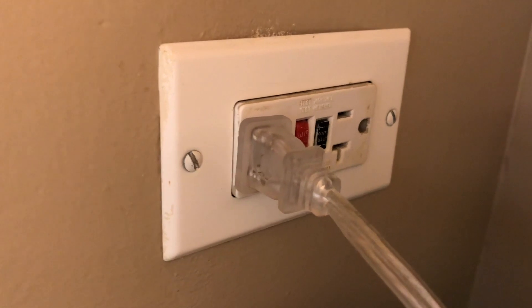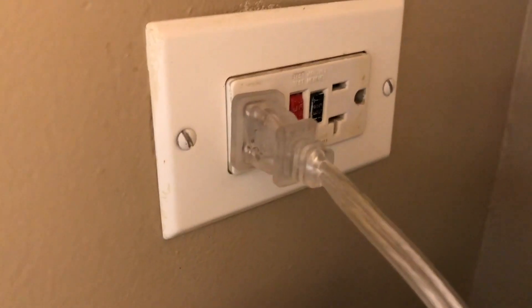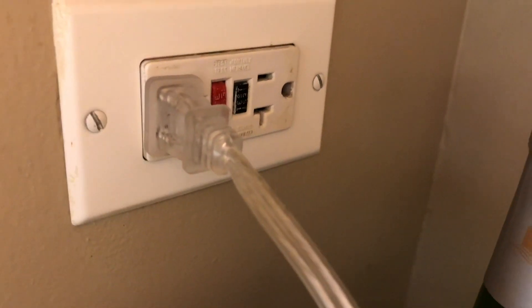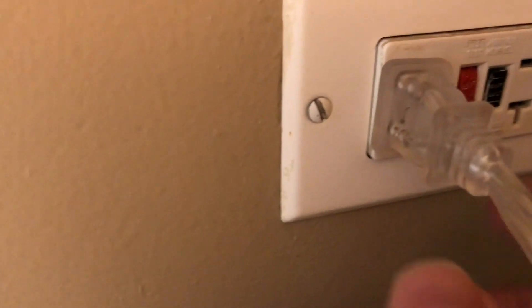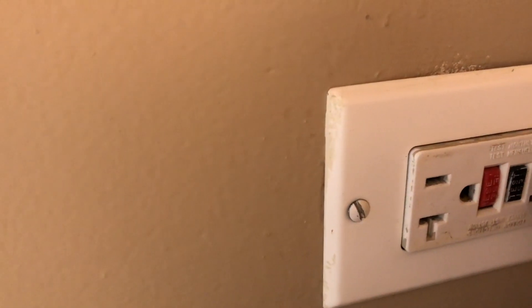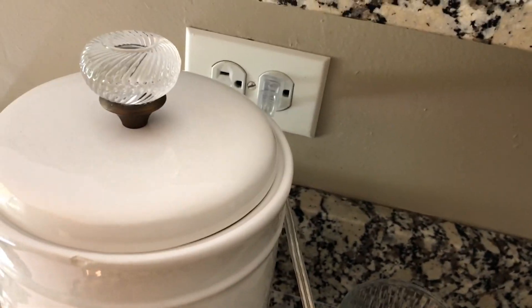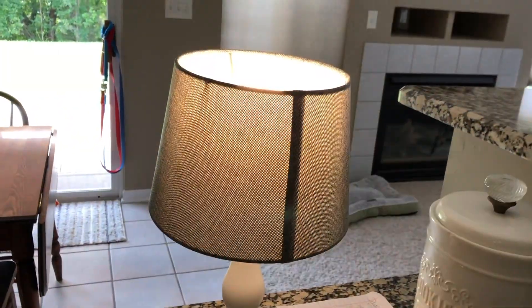The kitchen here is our next stop. We've actually got three outlets here that are hopefully controlled by this — otherwise I'm going to be replacing some outlets. Let's get back here and just test this one first. Yep, trips right away. And sometimes I like to do this just to make sure that they're both working. Plug that in over there and I'm going to push the button. So that one's on the protected outlet as well, as you can see.